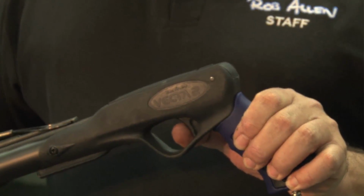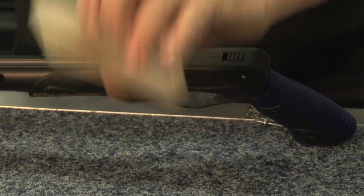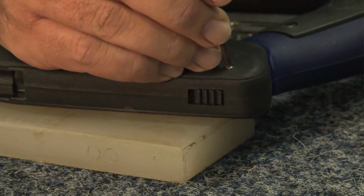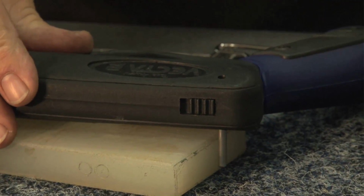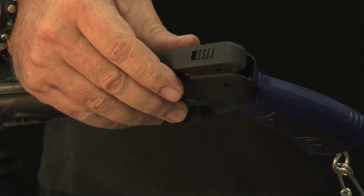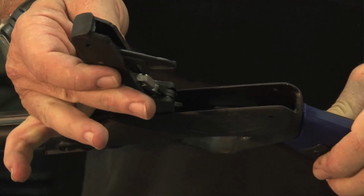Take out the shaft, lay it on its side, preferably on a block of wood. Tap the pin with any shaft smaller in diameter than the pin. The pin itself is 4 mm. That will open up a space at the back. There you can lever it up with a screwdriver, but most should just come out.